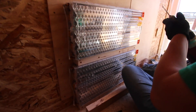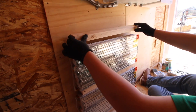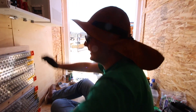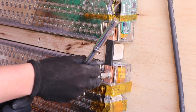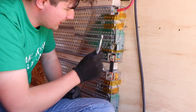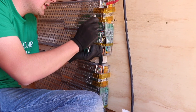Liam is mounting the Model S batteries. We used some two-by-fours and cut a little slit for the battery tabs because there are only holes on one side of the batteries. This is actually a really slick way of mounting these batteries right to the wall — nice and tight. Always when working with batteries and metal tools, watch where your wrench end is swinging so it doesn't short something out and blow up in your face. We're making perfect contact, nice and flush — we'll snug it down and then get the torque wrench out and torque it up.